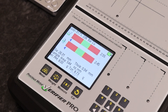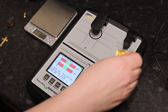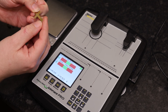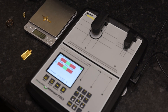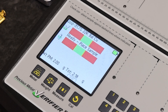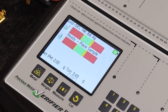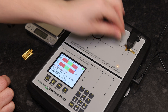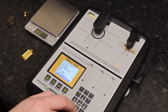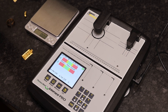If I shift it down to 22 carat, too much the other way — so it's more pure than 22 carat but not quite 24. We'll take it to the Niton tester to have a proper go, but we've got an idea now at least. This cross has a hallmark on the back of it which I can't read, and it says 14k. The weight is 2 grams. The sigma tester will only go down to 14k conveniently. Trying it at 14k with silver balance — slightly more pure; with copper balance — closer. We'll need a proper test on the Niton, but 14k doesn't seem far off.